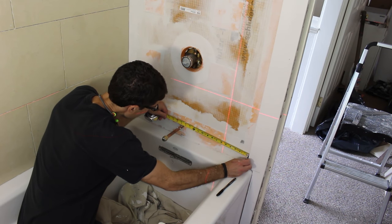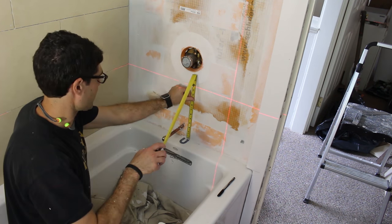To get the perfect hole in the right location, measure off the adjacent tiles or wall with a measuring tape, find the center of the hole, and transfer those measurements onto your tile. One way to preserve the life expectancy of these diamond hole saws is to continually dip them in water as you're cutting into your porcelain or ceramic tile.